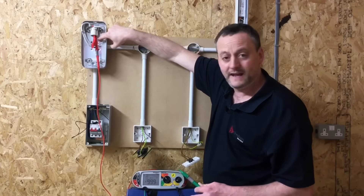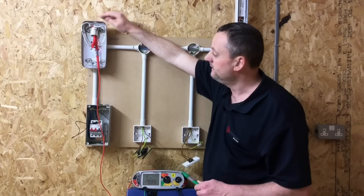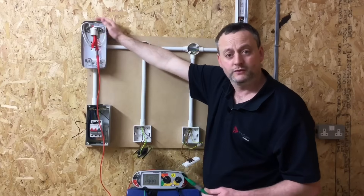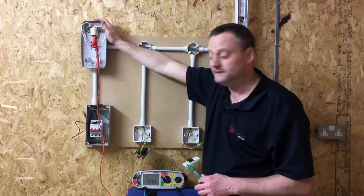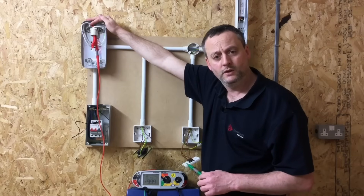I've proved the CPC gets into the actual bulkhead fitting, but I need to prove that the actual metalwork — the exposed conductive part — is connected to the CPC. So I can scratch the paint on the inside and go onto the chassis, and I can probe the lamp holder itself and a bolt at the bottom. I've chosen two or three different positions to prove it is connected to the CPC. Vitally important — the exposed conductive part must be connected to the CPC, not just that the CPC conductor is present. Let's go to a light switch next.